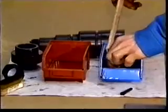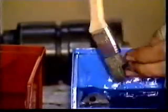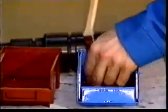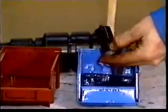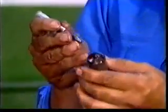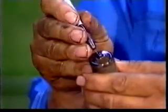Cleaning of the nozzle. The nozzle and needle will be cleaned by a coke dissolving agent. Before inserting the needle in the nozzle body, immerse the parts in clean fuel or a special oil for injection systems. Always clean the orifices with the special needles provided.